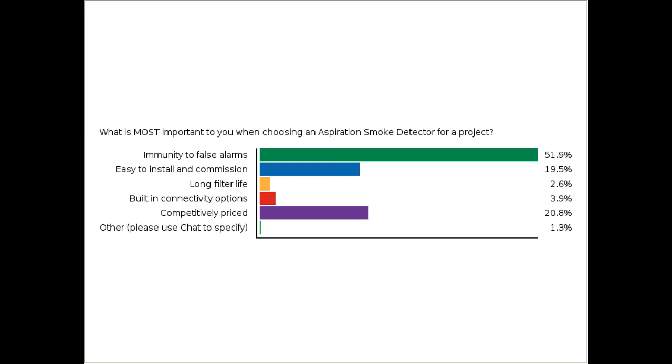And while you're doing that, I'm going to actually answer two questions that have been kind of frequent posts here. We've had 30 different questions that have been posted, and Nick is feverishly working at getting responses out on those. But two that have come in kind of commonly are, what fire panels can I use with FAAST? And the answer there is, in the conventional FAAST, it will connect to any panel via a module. For the intelligent versions of FAAST, the FAAST interfaces with Notifier, with Gamewell-FCI, Honeywell Building Solutions, Johnson Controls, and Fike.